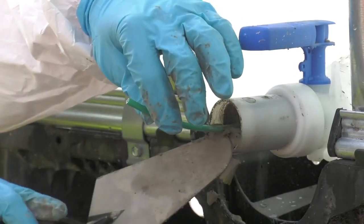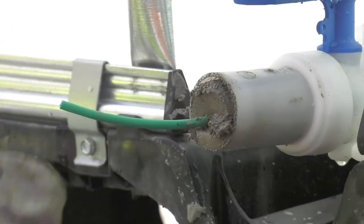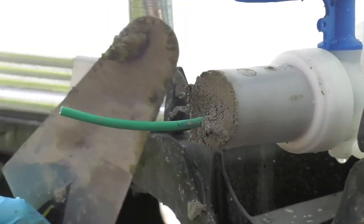This could be either Costa Repair Mortar Plus or Costa KB Fix 5. This final capping is to hold the cables firmly in position within the duct, preventing sagging which could cause gaps to form.